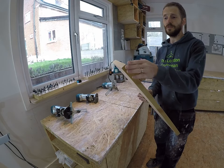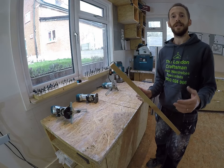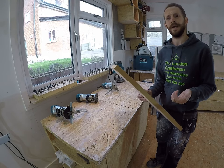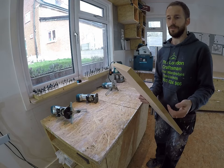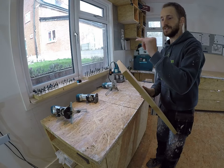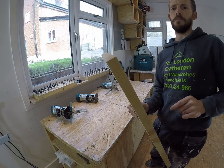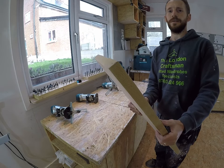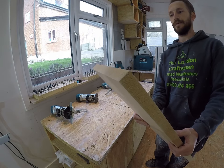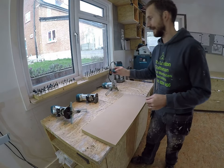A lot of people just use P240 on the edges and leave it at that, and I just think that's far too sharp — unless you're going for that look and it's a hardwood with a crisp edge. But if you're going down the furniture route — wardrobes, spraying, painting — you need to have a micro round. This is about a 1.5 millimeter radius. Something I would definitely recommend, and there will be a link below so you can grab yourself one. I cannot live without that little thing.